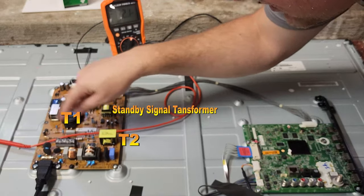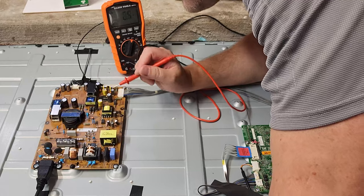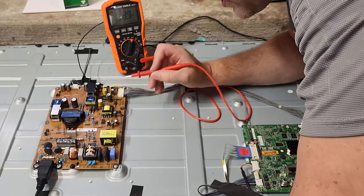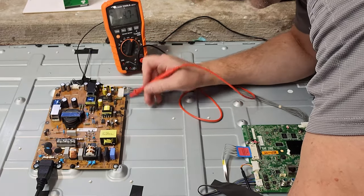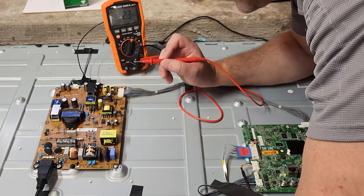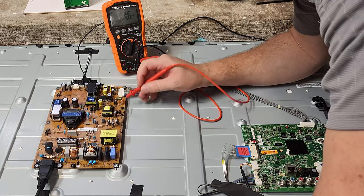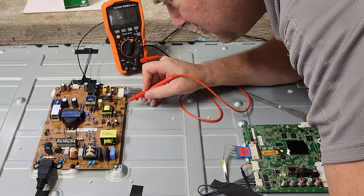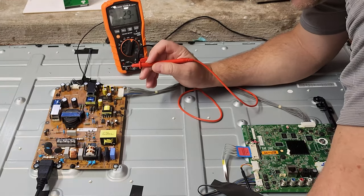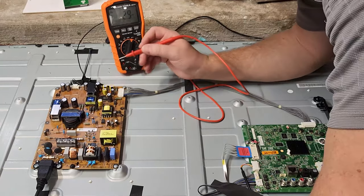There is another fuse up here — none of my fuses are bad. The TV turns on but then shuts back off. What I was figuring is that some of the lower-voltage phases, like the CPU rails — I've got two 3.5V signals and the power-on signal — the power-on signal fires once to turn it on, then the CPU rails, which are the two 3.5V rails, take over and latch so it runs off those.